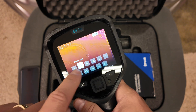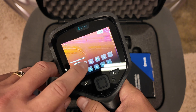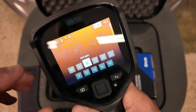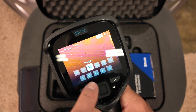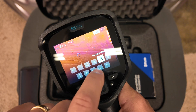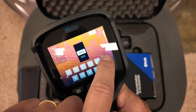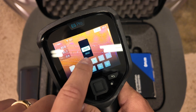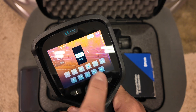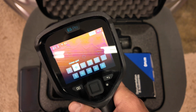You can also change the center spot settings. You can take it completely off for no temperature measurement, keep it in the center only, or set it to move. A red dot finds the hottest spot on the screen within the box, and a blue circle finds the coldest spot. You can tell it to find the hot spot and get several measurements within that box, or set a known temperature reference to compare your readings to. The manual will describe all of that in more detail.